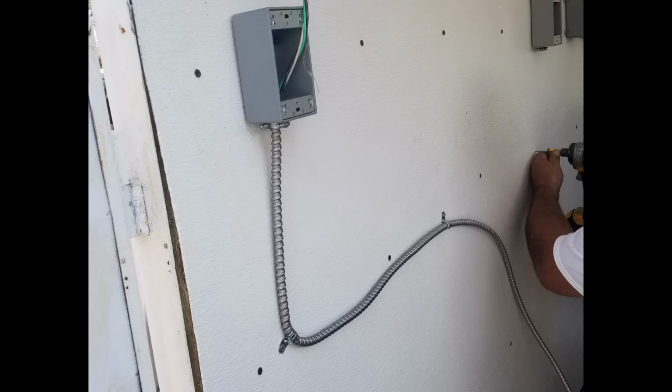Also, I did my walls first and put in my electric after that. Some of you may want to consider putting your electric into the walls. I ran my conduit on the outside of the walls and ran it a little bit high above the equipment line, but some of you folks may want to consider running your electric through the walls where the insulation is. There are different types of conduit that you have to get for inside the wall versus outside the wall, so make sure you check with your electrician on what type of conduit goes where.